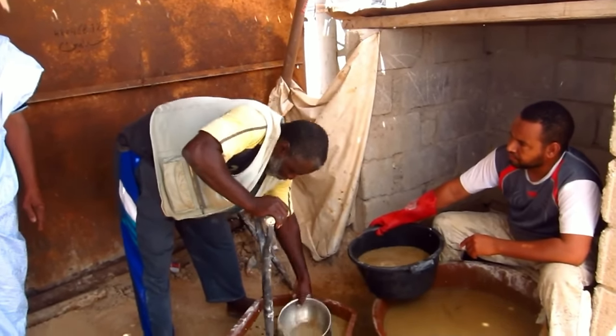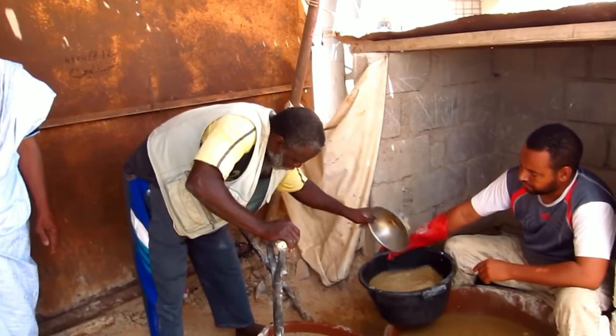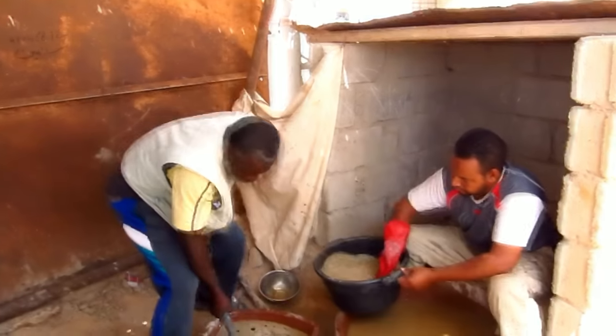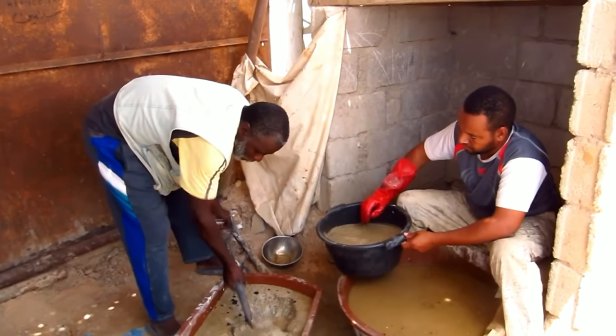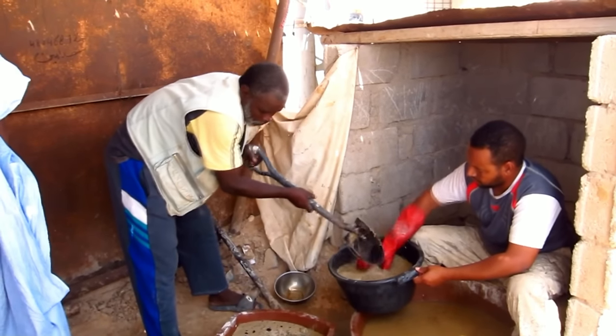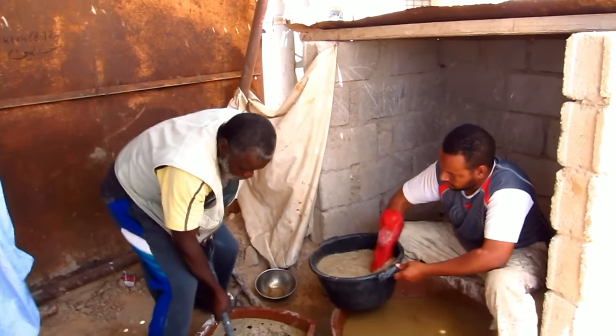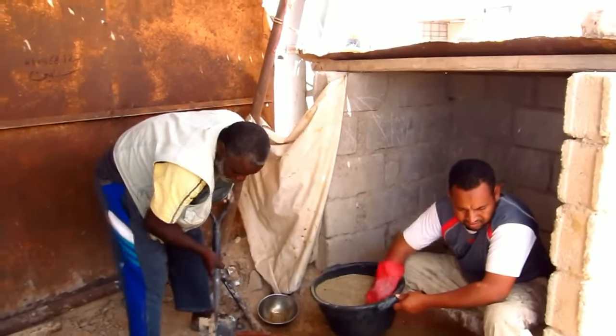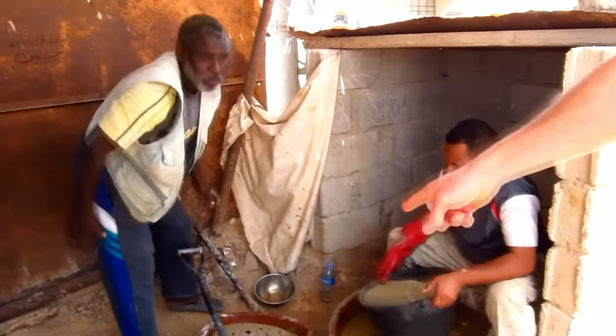These cone mills hold about 10 sacks of ore, and depending on the hardness, they can run the cone mills for anywhere between 8 and 24 hours for 10 sacks, and each sack weighs 50 kilograms, so they can only process about half to one ton per day. But it's coming from the drum, yeah? The mercury is inside.